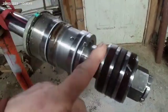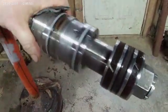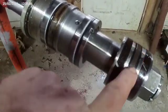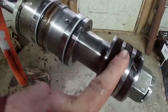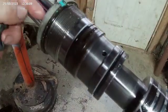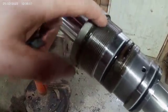You'd pull your nuts or stretch the rod and your piston would come loose. As you can see, that piston is nice and tight still — so that is how that works. This is your main seal that actually seals the piston to keep the oil on this side and keep the oil on this side. These seals are what keep the oil from blowing out externally past the gland, and then there are seals on the inside as well. There's also another backup ring right there.